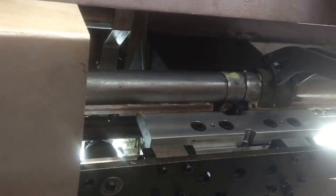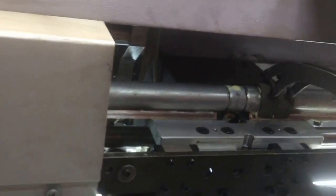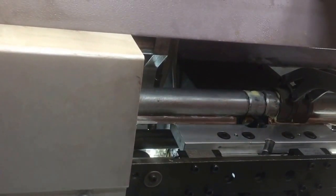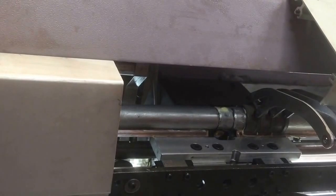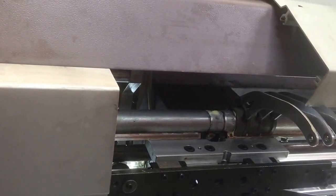Be mindful of the electricals. It's 24 volts, but it is a safety circuit, so a break in either wire and the twin pair actives will stop the power to the machine and the auxiliary light, and also activate the brake.